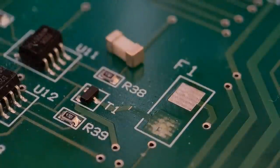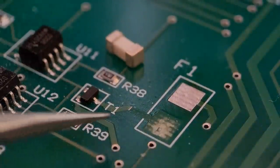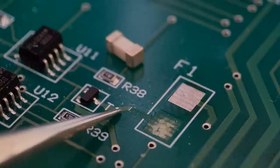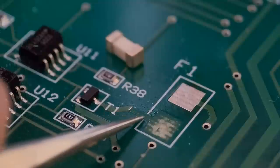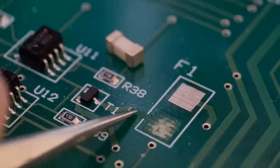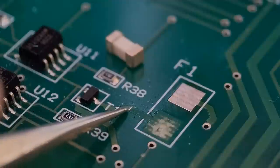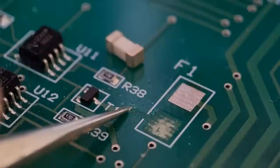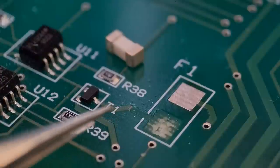So as you can see, got a lovely cut there. You've got a perfectly solid bit of trace there to attach the new copper pad and trace that I'm going to make out of the copper tape. And that will be the next stage. Like I say, where it stops lifting, come back about half a millimetre, and then you've sort of got solid ground to work with.